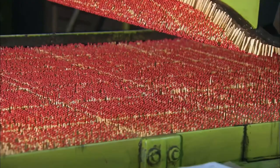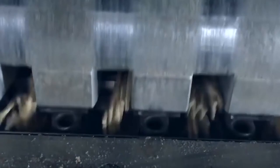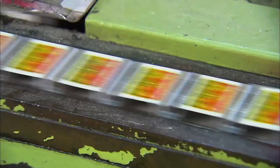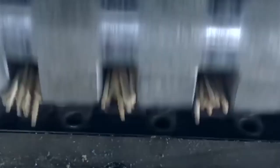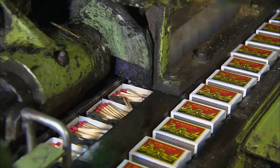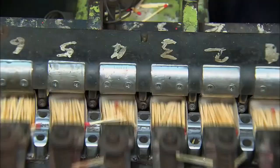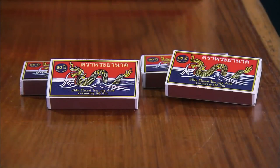During assembly and packaging, the completed dried matchsticks are pushed out from the conveyor belt onto a regular conveyor below, which is shaken at a specific incline and rate to align all the matches. Further down the line, bins of inner boxes and their sleeves are emptied onto their respective conveyor belts, which feed into a filer that puts them into single files. These are brought in parallel while the matchsticks travel above, until they reach an automatic filler that deposits a specified number of matchsticks into each inner box. A machine vibrates the boxes to shake off any excess matchsticks, then another machine pushes them into the sleeves, completing the matchbox. All in all, the station can process over 500 boxes a minute while handling nearly 200 matchsticks every second. The completed boxes then make their way down the packaging line, sorted into piles to be sold to millions of people around the world.